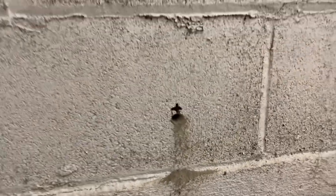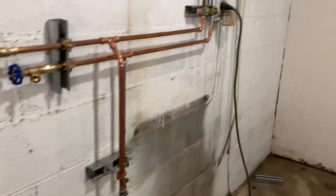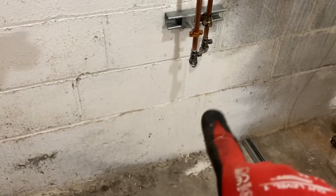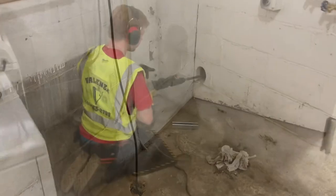I drilled a pilot hole through the foundation. They located the bit outside, so now I know what my elevation is going to be inside. I can start putting my hangers on the wall, getting it pitched correctly, and we can start getting the 4-inch hole drilled through the block. Ian's going to do that, and we're going to start running the 3-inch ABS across and getting our fixtures tied in. The washing machine's going to go there, a tie-in for the slop sink's going to go somewhere there, and we're going to stick it through the wall.